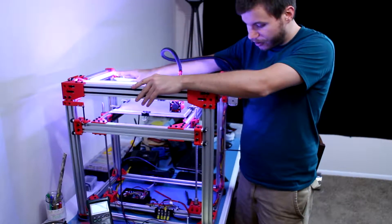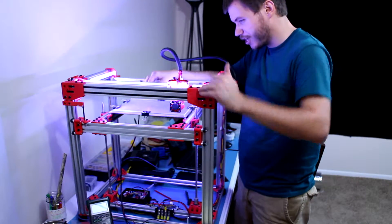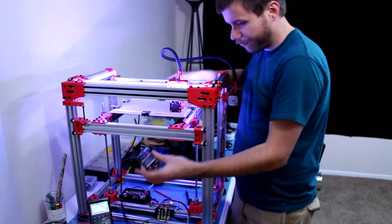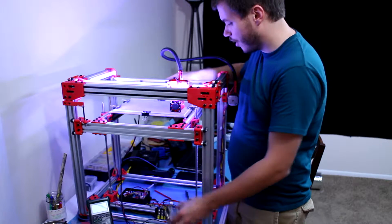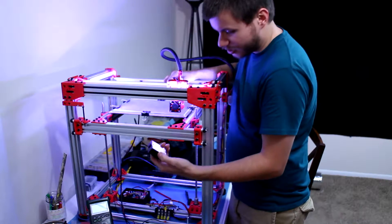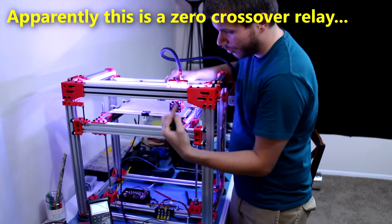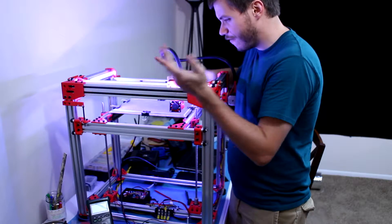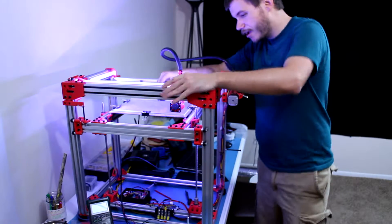As you can see, I wired up the LED lights — it's a temporary wire job with small strands in the screw terminals. The bed heater ran into some issues with the cheap Chinese relay I got; for some reason it's either always on or always off, so the bed was just heating up randomly. I've been reading online that this is the wrong type of relay. I'll post the name and put a link in the description for a proper relay — I found it on Reddit and it has good reviews on Amazon from people using it as a 3D printer relay.